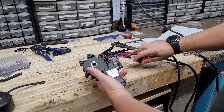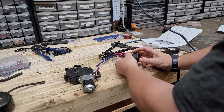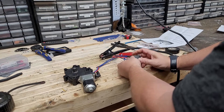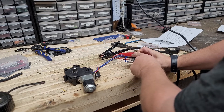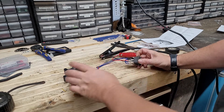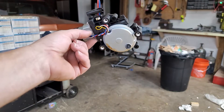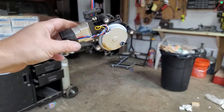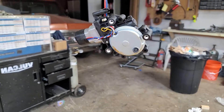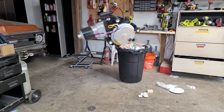This is a reversible switch. The wiring is simple - positive and negative go in the center. This way switches these two, this way switches these two. All I do is run positive and negative in over here, jumper it, and switch the two - so that reverses the polarity. There are some extra wires right here on this particular model; I just cut them, taped them so they don't get in the way. They do some magical task that we don't need to do.